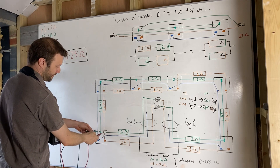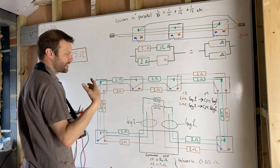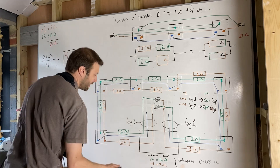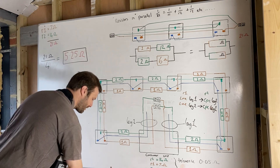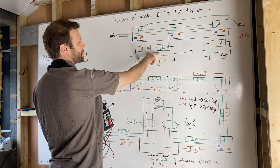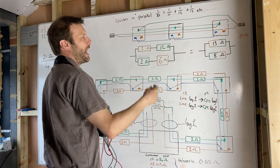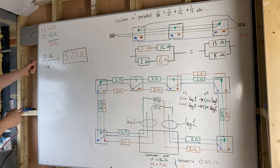On this leg back the other way I've got two ohms to this point. As it continues through the circuit I then get one, two, three, four, five, six ohms before getting back to the testing point. Now I can add these up because we've got resistors in parallel: one ohm plus 12 ohms is 13 ohms, two ohms plus six ohms is eight ohms. I add those two together and get 21 ohms — which is what I'm looking for — and divide by four to get 5.25 ohms.